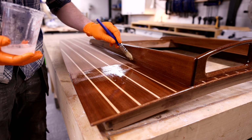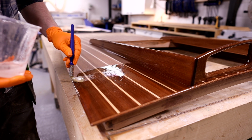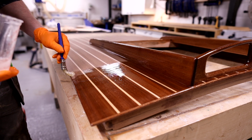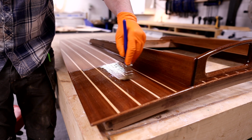the resin. As the resin soaks into the wood, the air that is within that wood grain that the epoxy is replacing starts to come out, and that's what happens with off-gassing. Because the epoxy resin is a really thick product, it tends to hold bubbles in the surface. So you need to make sure that you tip this several times to get those properly burst.